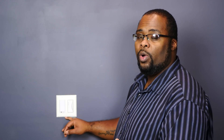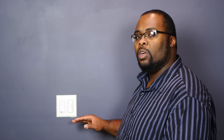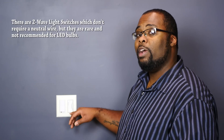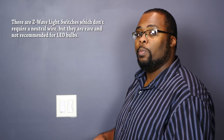Both of these you see here are actually Z-Wave dimmer switches. They wire into the wall like a regular light switch, so you do need to know a little about electricity and be comfortable with wiring. I'd normally recommend a Z-Wave dimmer to somebody with a lot of different lights — I have about 15 bulbs on one circuit in my basement, so it wouldn't make sense to buy a bunch of connected bulbs. You'd rather spend 30 or 40 bucks on a dimmer that controls all the lights. The important thing is to make sure you have a neutral wire in the box — it's usually coiled up and taped off in the back, since it's not used for regular light switches, but you do need it for a Z-Wave switch, because the Z-Wave switch is always powered on to maintain a constant connection to your hub.